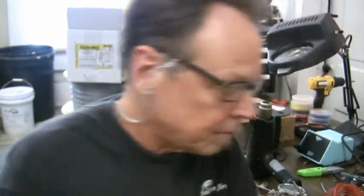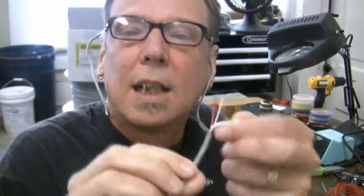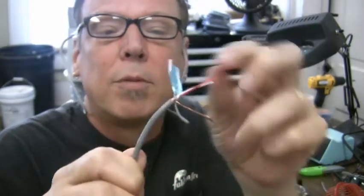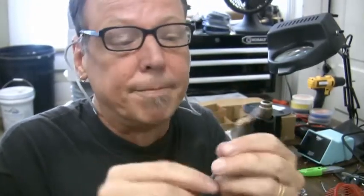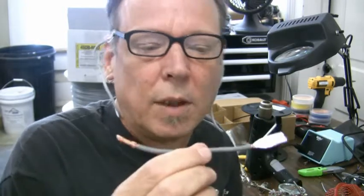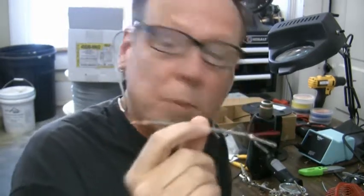The next type of cable, you could use for a mic cable, but you probably wouldn't, because again, it still has a foil shield. You can see on this end, it has a braided copper shield on top of a foil shield. This gives it even better noise rejection. But still, because of the geometry of the shield, it is prone to making high frequency noises if it's stepped on or bent suddenly or any of those things. So again, it's generally used for more high-end applications. This is more of a studio quality wire for installation, so it's just a little bit more expensive than the cheaper stuff.